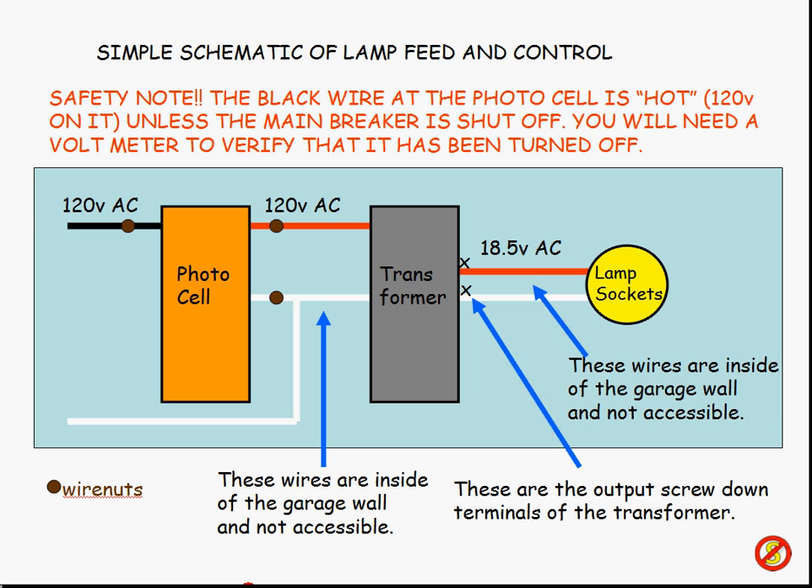So the photocell has got to be the culprit — it's locked in the closed position even in the daytime when it shouldn't be. Now, a safety note: for those of you not familiar with electricity, anytime you're messing with 120 volts that can be lethal. This thing is hot all the time unless you open the circuit breaker or take out the fuse. I've been doing this a long time so I did mine hot because I didn't want to go find the breaker. But you really should turn off the power at your breaker or fuse box if you're going to change this photocell out. You'll need a voltmeter to confirm the power is off — it's just bare wires with wire nuts, and the only way to tell is with a voltmeter. It's a simple thing, but you need to do it safely.